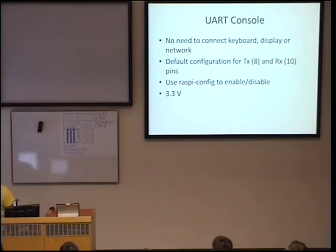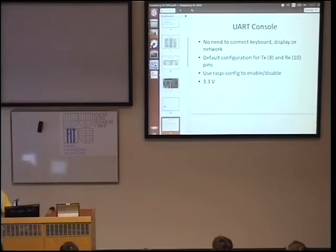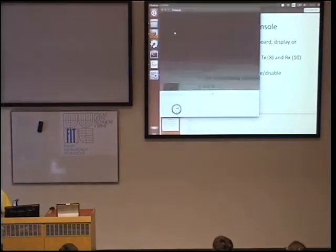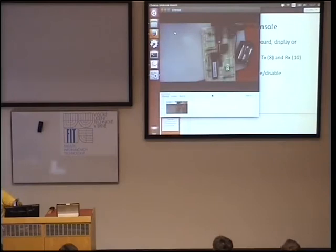I will try to show it. So, let's go here. You know the basic solution of everything from Microsoft, restart it. So here you can see it's a converter, USB to serial port, and this one is 3.3 volts, so be careful to buy the proper one, because much more common is that those converters work with 5 volts logic. It destroys the Raspberry Pi.